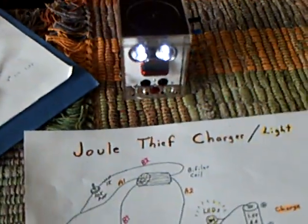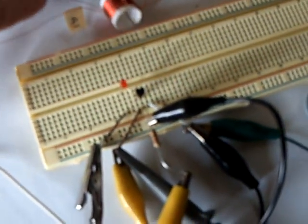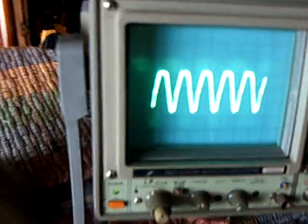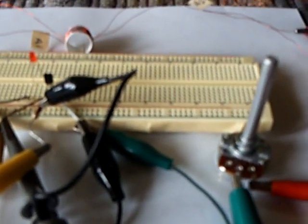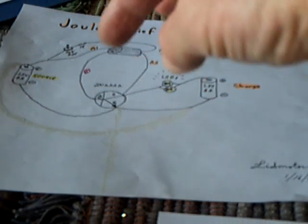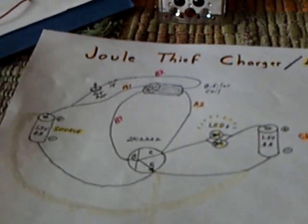I think what's happening is these coils are resonating. I also found out I could do this with just a little air coil — just wires wrapped together — and it'll make the circuit do its thing. There's the sine wave on it. This is running at 40 milliamps; the systems over there are running at about 20 milliamps or less. What I wanted to show here is that the resonance changes as you vary the voltage going into the base, using a potentiometer at the transistor base.